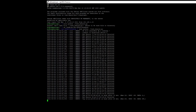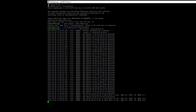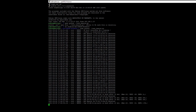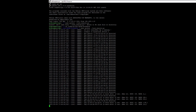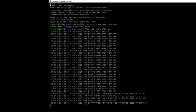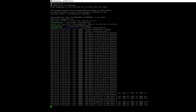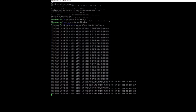This will start to filter them out, and what you're also looking for is very low RSSI signals. The higher it is, the further away from your Pi the actual Bluetooth that's coming back is. So these 2 here, 21 and 24, very likely to be these 2 tags. Well, I know for a fact that they are these 2 tags, because I've already sorted that. Now I struggled with this to begin with.